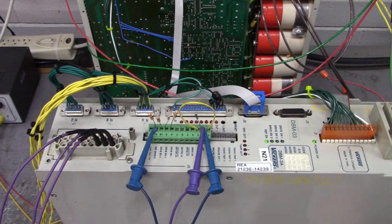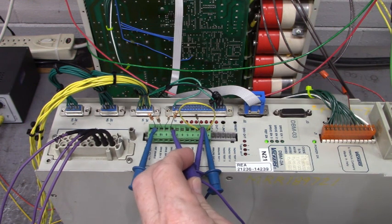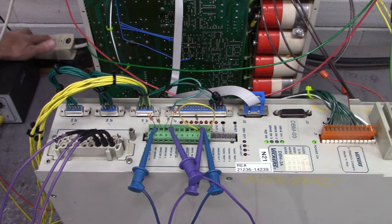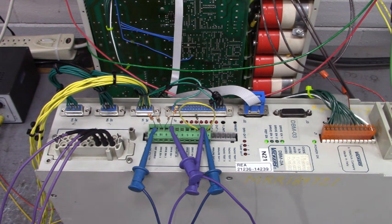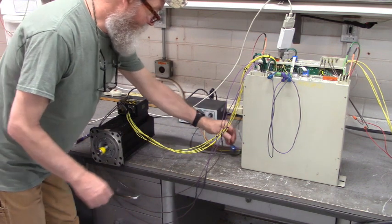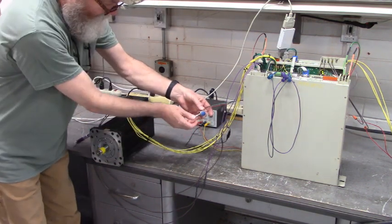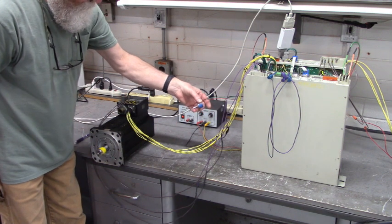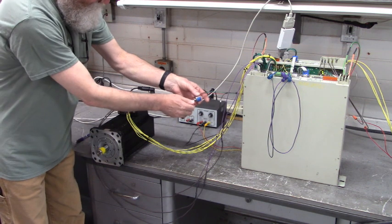This terminal right here is plus 15 volts DC and we switch that to ref enable. Now we're going to turn that axis on. We're moving — that's axis one. I'm going to move back a little bit so you can see that motor running. Let's switch direction — that's my speed and direction pot right here. Now we're moving clockwise. Let's go counterclockwise.